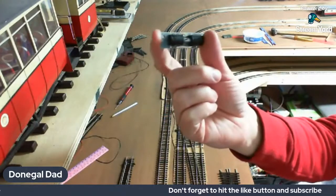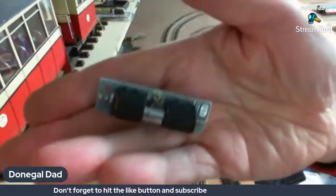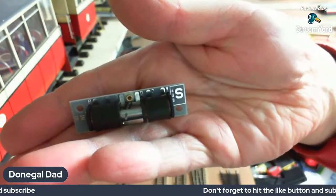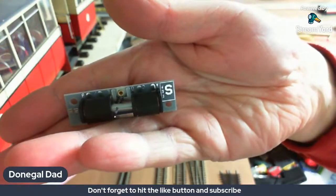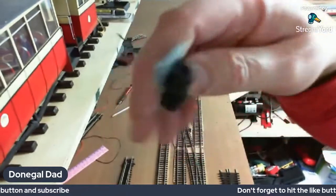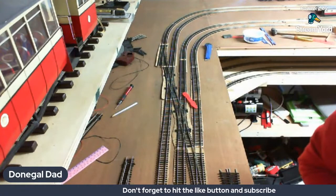So it's the same as my wiring convention, because you've got points D and E where the droppers are connected to go onto the bus wire. D is the positive and E is the negative, the black. So again, the orientation is you make sure when you put it underneath, the black wire is towards the back, and that keeps you right.